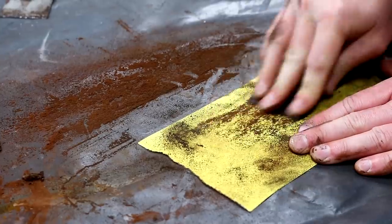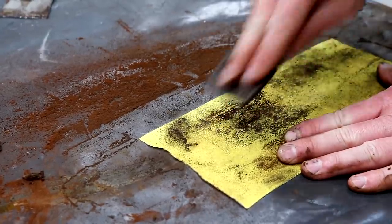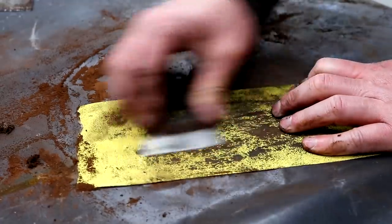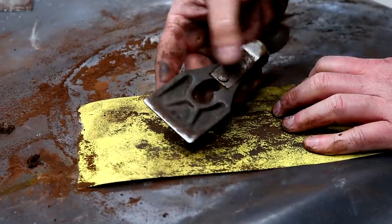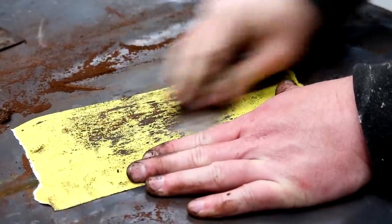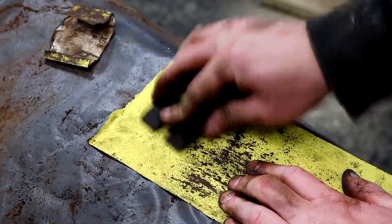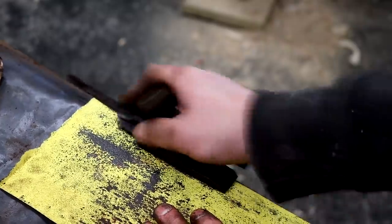I did the same again to the sides, and I also sanded the lever cap. Again, I'm not aiming to remove all of the rust, just the worst of it. My aim with this project is just to get a tool that works really well — it doesn't have to look perfect, and it'd be difficult to do that anyway because of the extent of some of the pitting and damage this plane has suffered over the years. I also want to clean up the face of the frog and make sure it's nice and flat, because the cutting iron is going to be secured down to that surface.